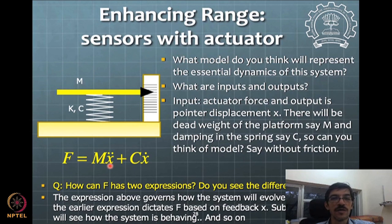By the way, to balance this, if we use a screw kind of system to drive the actuator, meaning the motor and the screw type system, then since it is not back drivable, that will not work here. Anything which has a large amount of friction will not work for such a thing. So we will need to employ a non-contact linear actuator, which will drive the system to make things zero. You need to be aware of this.